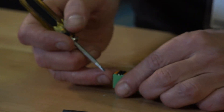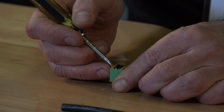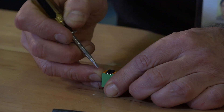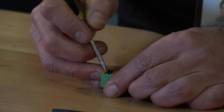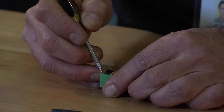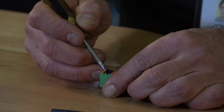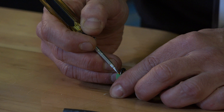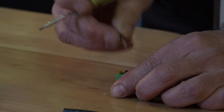To do that, take your small flat blade screwdriver and push down on the orange tabs to release the jumper wires. Push down — you'll hear a small click. Push down the other side. Do this a couple of times; it's slowly releasing. Note it's spring-loaded so it may pop out. Press it a few more times to get it to completely release.